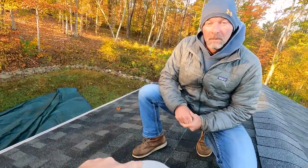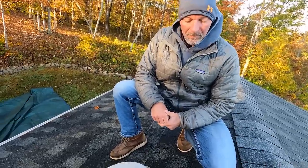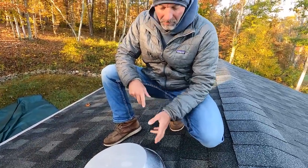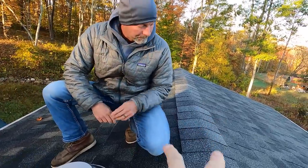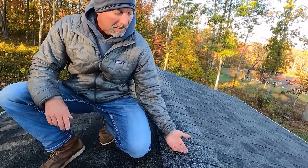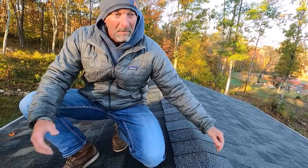Underneath here I have a little bit of a water problem, a humidity problem in this section of the house. Could that be why I'm having a humidity problem? Absolutely — there's water clearly penetrating in right there. These vents are known for problems anyway. This isn't the type of vent I would put in — we're going to eliminate these and put a ridge vent, fill wood back in the holes. We'll cut about two and a half to three inches all the way down the center of the ridge — about an inch and a half per side — and it'll allow heat to escape up and out. It's real important that you have soffit vents as well; we want air to be able to come in and go out. On a mobile home there's no soffit overhang, so inside the home are vents in the ceiling that draw drier air up through the house. Your house has to breathe — if it doesn't, humidity will get in and condensation will drip right on the roof.